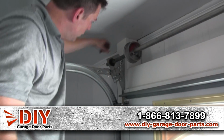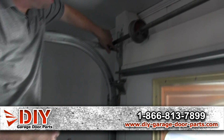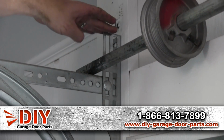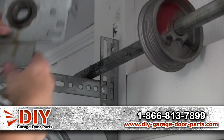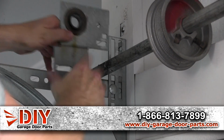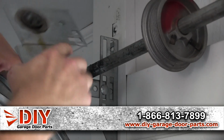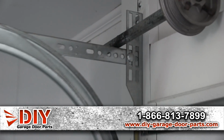So how you can tell this is 12-inch radius is this piece of angle doesn't go to the top of this flag bracket. If it was 15-inch radius, it would mount up here. And usually if it's 15-inch radius, they'll put 2 bolts here, and then they'll use a lag to mount it back here so it doesn't tilt. Sometimes they'll forget to do that, and that's what will wear out your end bearing plates prematurely.